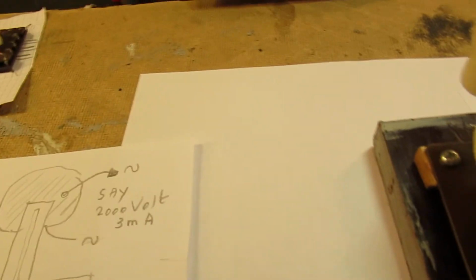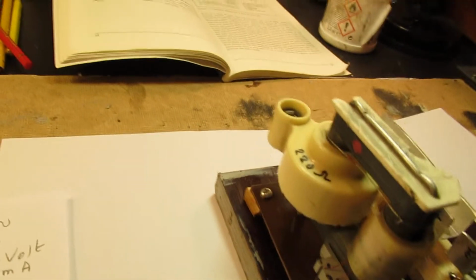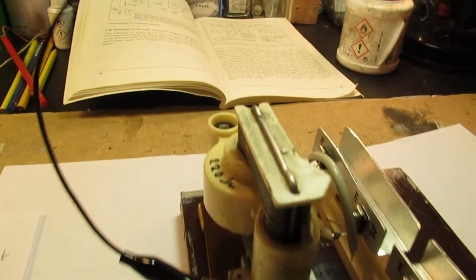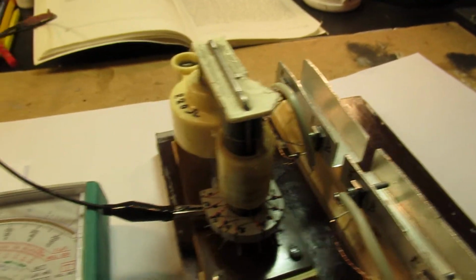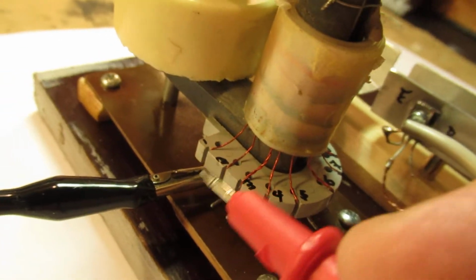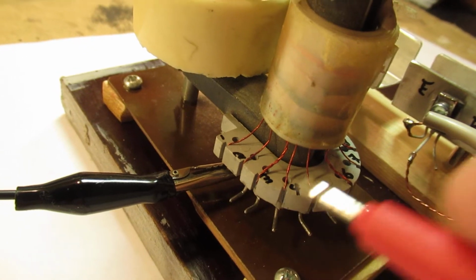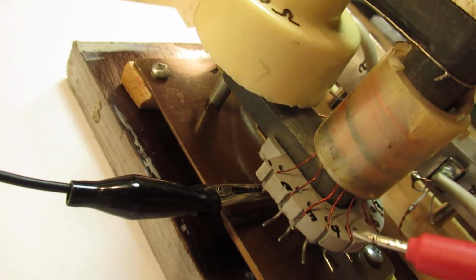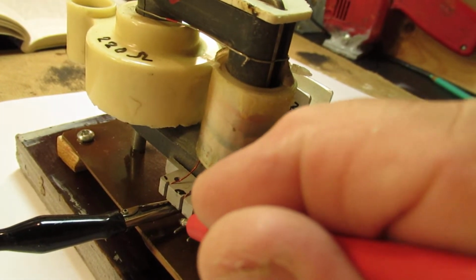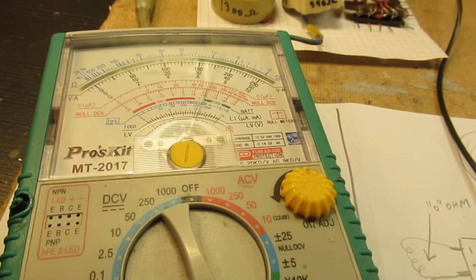So, what I wanted to tell in the first video is that we have here a lot of electrodes. So, the first good idea is connect your crocodile clip of the ohms meter. I cannot show that together, but anyway, connect your crocodile clip here to the first electrode and then measure with your ohms meter to all the electrodes that are on that primary coil. So here, and you can see, for instance, this. Measure it.